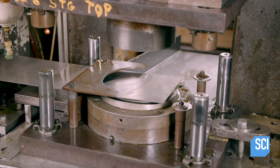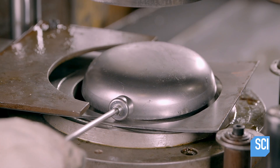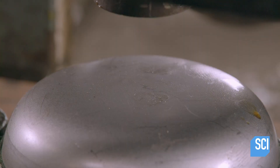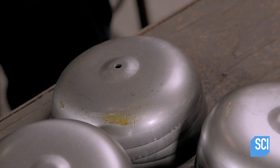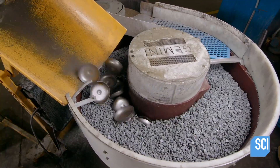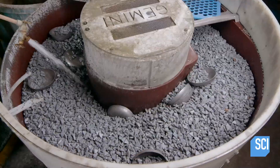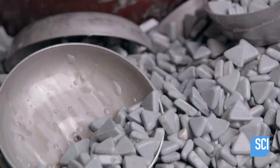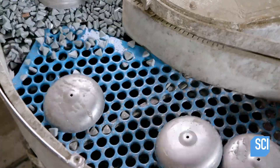At another station, a boxing bell begins to take shape. An assembler transfers the bell to a punch that cuts a hole in the center; the punch forces it onto a form that contours the area around the hole. Oil keeps the metal lubricated as it's forming. The gongs then tumble around in a machine with vibrating ceramic stones, detergent, and water — the stones scrub off the oil and rub off rough edges.